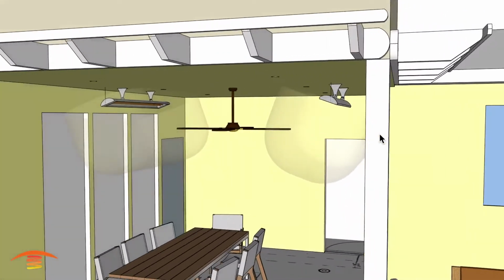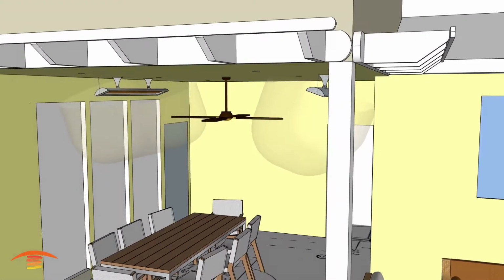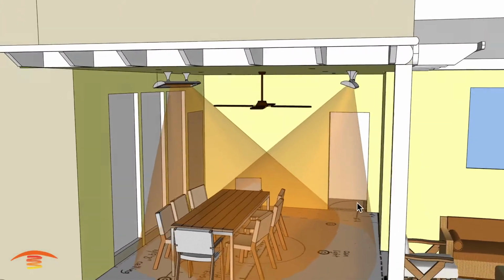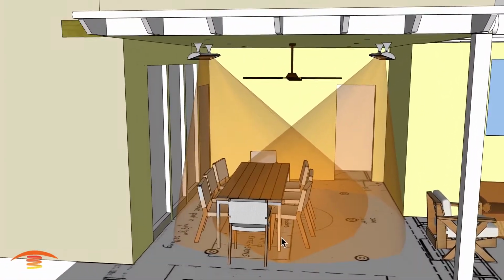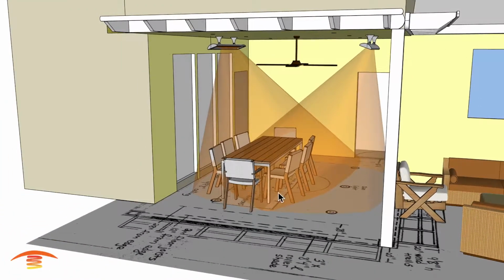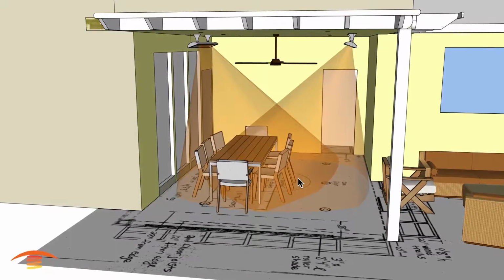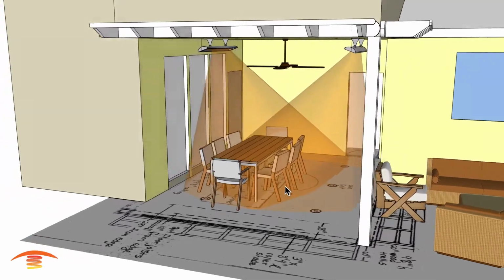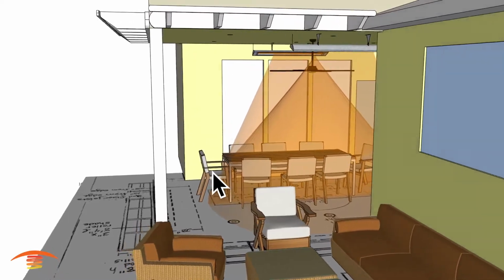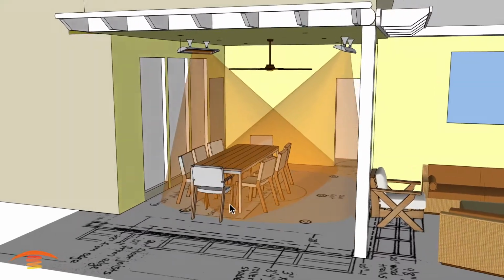All right, so that would be the CD 6024, 6,000 watt, 240 volts. Those are 25 amps a piece, so it takes a lot more power. Let's go ahead and look at the footprint of heat. And you can see here we got a much more ample amount of heat. If you were to look at the BTU demand, it would demand somewhere in the nature of 2.1 heaters for the space here. And again, we still have that issue with hitting the outer chair here. So that might be an issue, but something to consider.